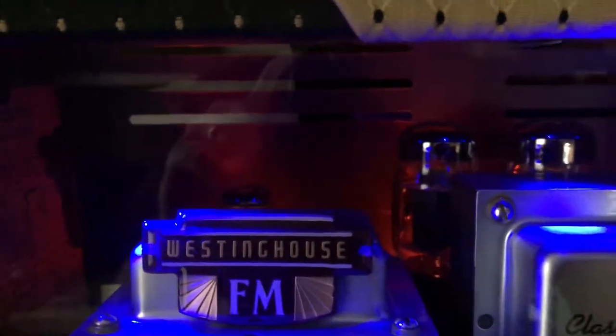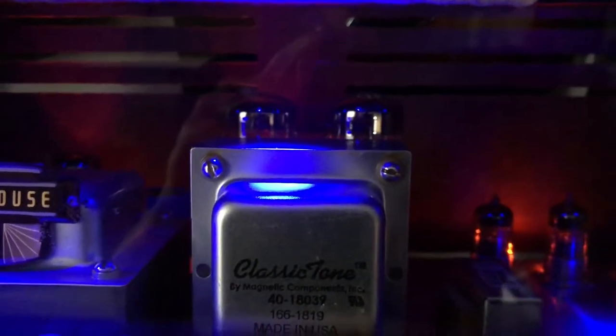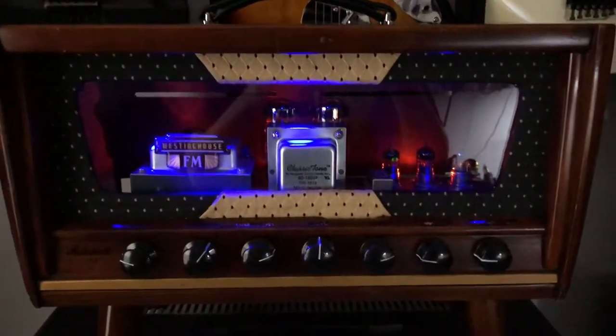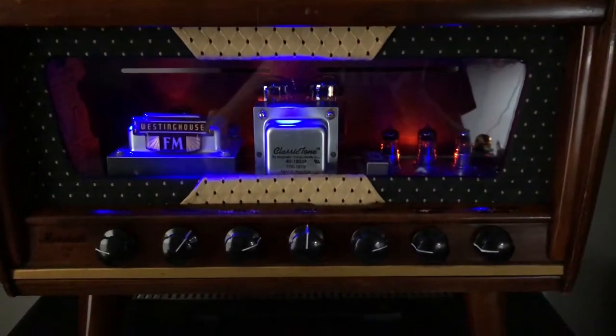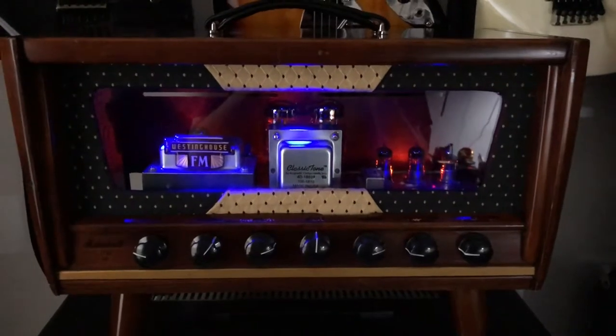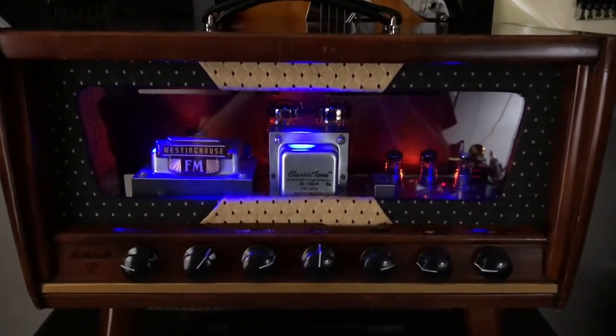I built a custom back, and this is sort of out of a material called hardboard, and it's ventilated. So I added these holes to kind of ventilate it inside, so it's not completely closed. And it also has some ventilation. If you see behind the tubes there, there's a little bit of an opening, and I'll show you the back in a minute. So the features for this, as far as its playability, it's exact specs to the Marshall JTM45. However, I have added some cool bells and whistles to it, and that's what we'll go over next.